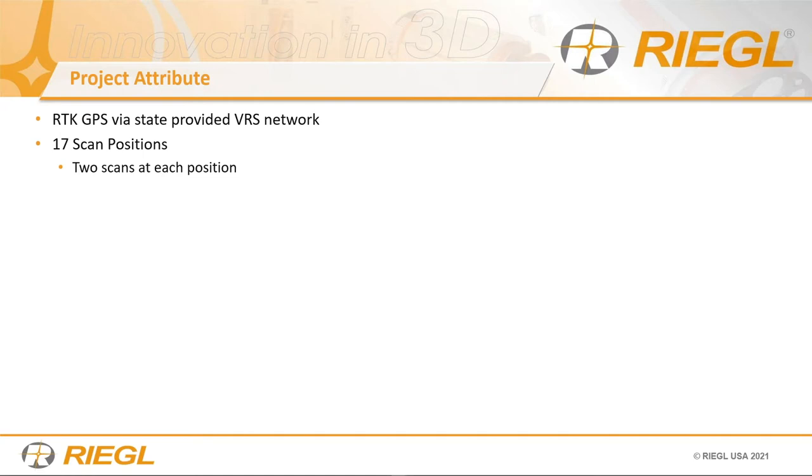You can get online two ways: put in a dedicated SIM card with a fixed IP address, or Wi-Fi tethering. You have to understand that GPS is used but yet also improves registration. By having RTK, it only makes your registration better, easier, and faster. If you were to take the same project — 50 scan positions with an L1 receiver with no correction versus with correction — your registration is going to go quicker because the position is much more accurate, so it looks for orientation matching planes from one scan position to another.